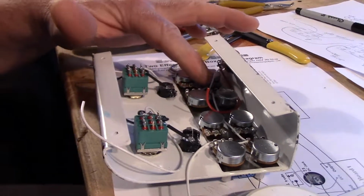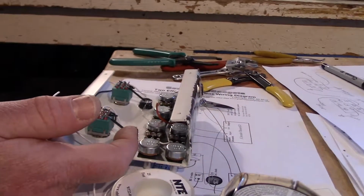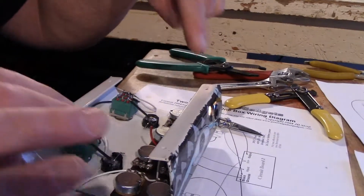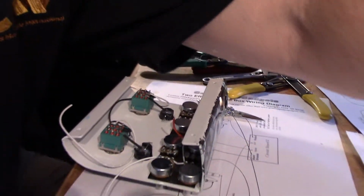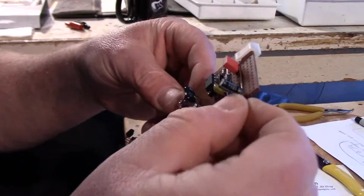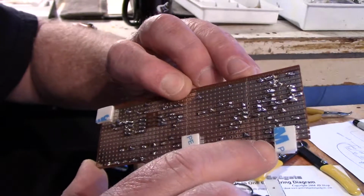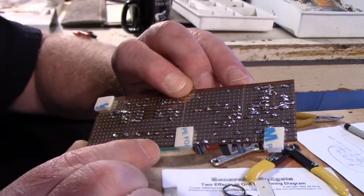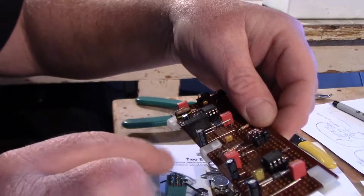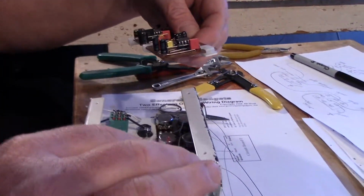What I'm doing right here is linking up all of the grounding points. Of course, over here will be your output jack, so that'll get a ground wire, and then I just chain it from one spot to the next. Then there'll be this entire bottom row of the Veroboard right here. That is our ground bus, if you want to call it that. Anywhere along the board here, I can choose this first row and a single wire to connect up with one of these grounds.